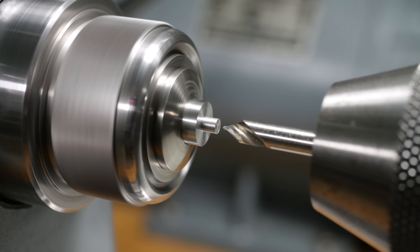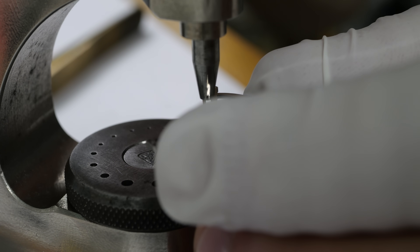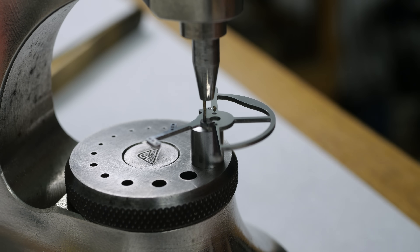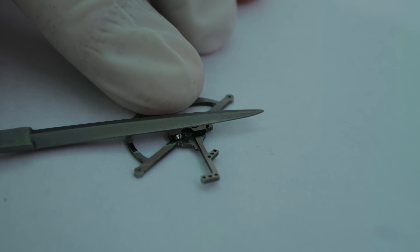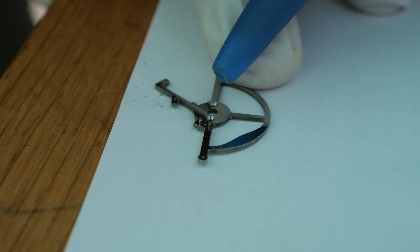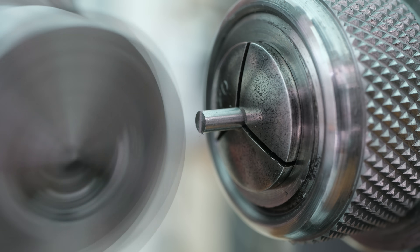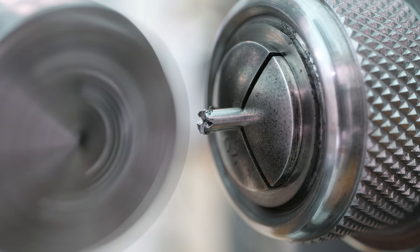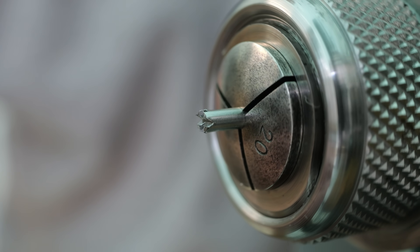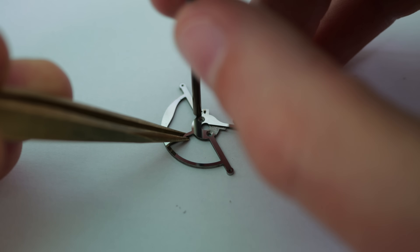To drive in the adjacent pin, I make a custom anvil for the staking tool, which is required to provide clearance for the first pin. With the pins in position, they need deburring. This is a bit tricky because it's difficult to do with a file, so we need to make a special tool. This is a 60-degree fly cutter I made previously for a different task, but I can also use it to cut two perpendicular grooves in a piece of steel, which, once hardened and tempered, works great for removing that annoying burr left on the pins. I didn't bother to align the fly cutter on the centre properly, but it doesn't impact its efficacy.